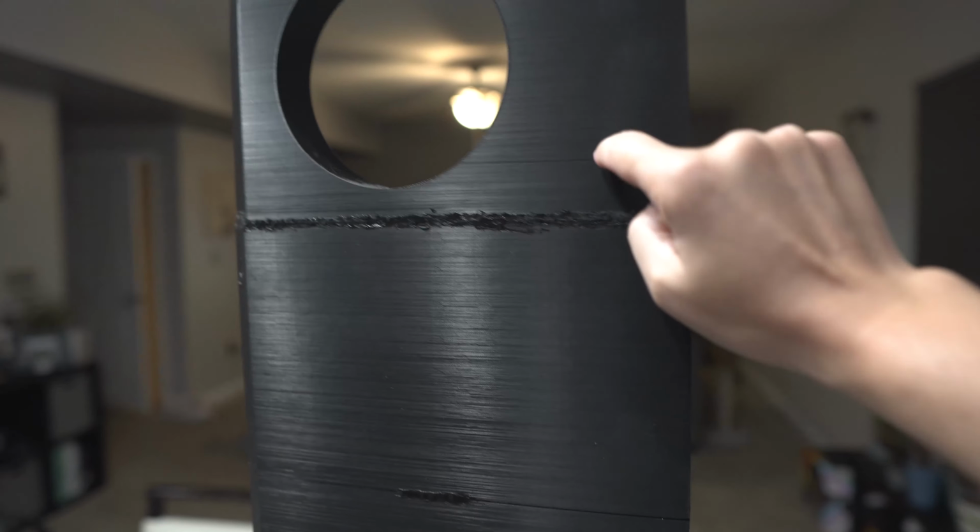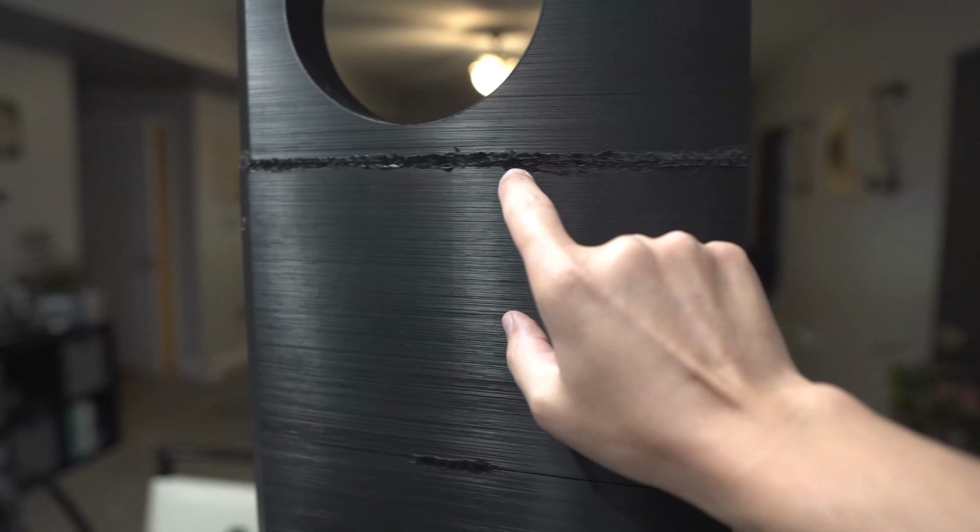After a couple of days of printing, I have most of the pieces already there, and as you can see in the video, I started to plastic weld all the pieces together after I attached them and glued them in. If you don't know what plastic welding is, basically you take a soldering iron and melt the pieces together to create a really strong bond. What I did is melt both pieces together along those little lines, and at the same time melt the same filament, the same plastic of the print, into those grooves to create the strongest bond possible.